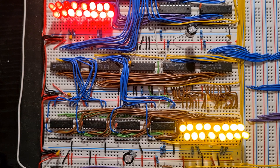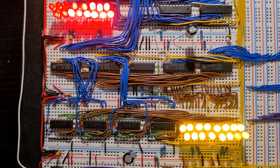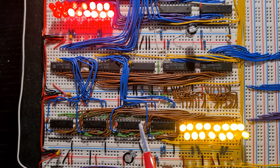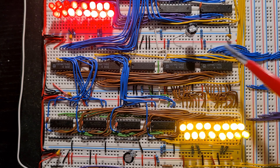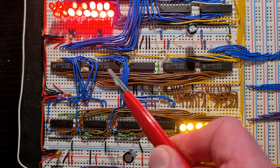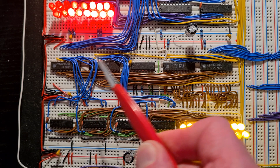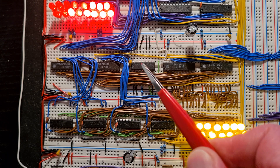The yellow LEDs show the state of the 16-bit stack pointer, which is stored in four up-down counters, and the upper and lower bytes can be put on the data bus. The main purpose of the register is to access memory via the 16-bit address bus.